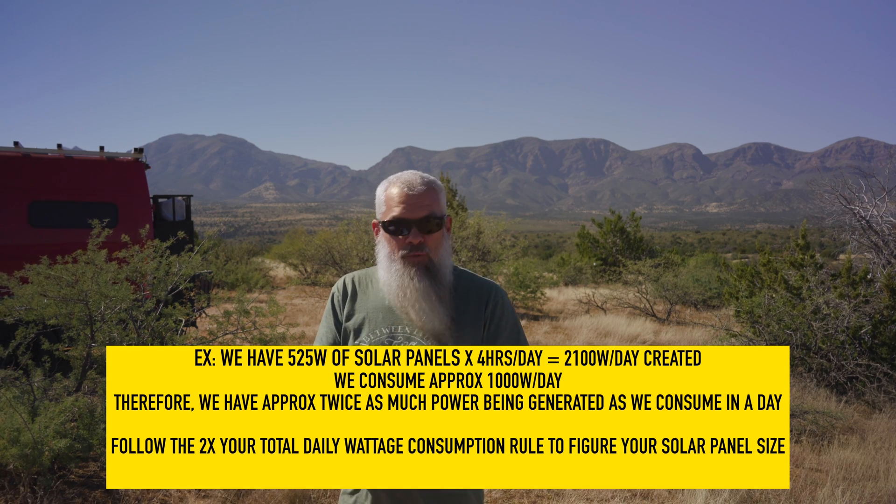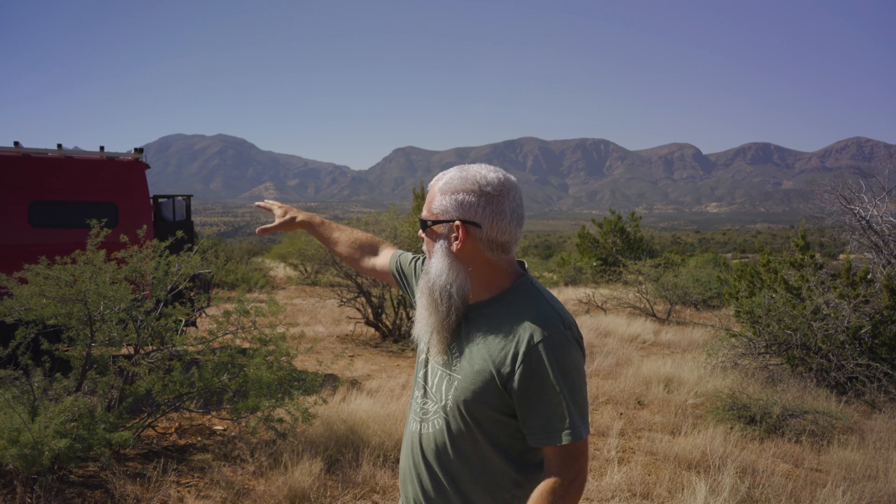We've seen as low as two hours a day of full solar output, which for us would drop to 1,050 watt-hours — barely scraping by. That's where we end up in winter. It would be nice to have one more panel. Another option is to supplement with portable panels you can lay on the ground and aim at the sun, which we use for two or three months in winter while we're staying in one area. Once you start doing this math, the solar sizing really starts to make sense.